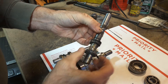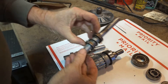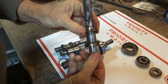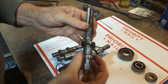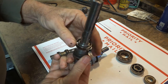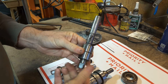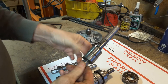I had to cut this one apart to see the insides. This is the old school style that I sell. But Shopsmith has gone to a newer style with two bearings, and I only used a couple of them and they both disintegrated within a year or two — definitely wimpier than the old school ones. If you have this newer style, I'd just get rid of it because it's going to fail pretty soon. They've only been using them for seven or eight years now. This one feels rough and the shields have disintegrated. I just think they're bad news. If you opened up your machine and found this type, I'd just get rid of it and buy one of the old school ones — they typically go forever. But if you feel any roughness or see grease squeezing out, you could replace it, though these rarely do go bad.